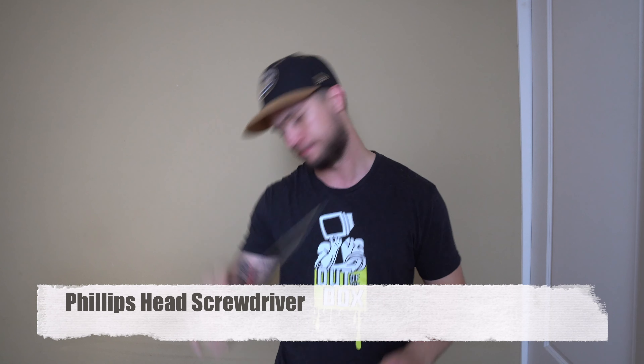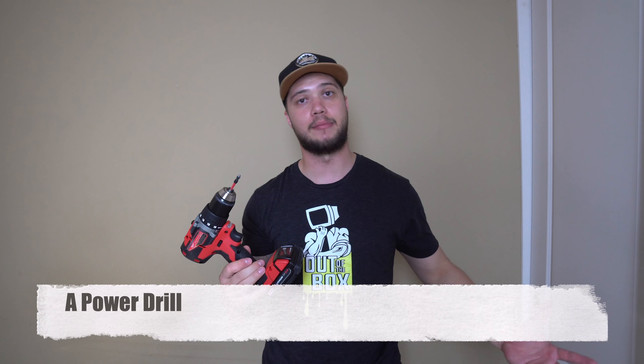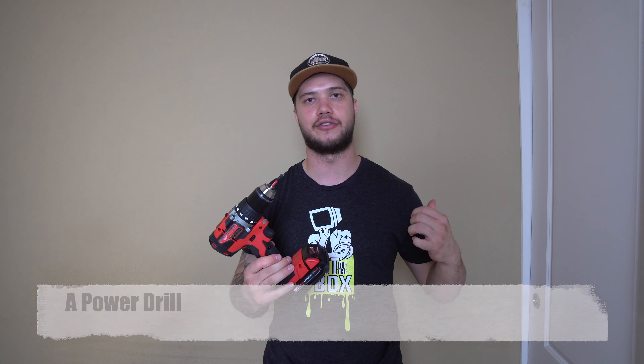So there are a few simple tools that everyone's got laying around their house that you're going to need to mount this TV onto the wall. First and foremost, you're going to want a Phillips head screwdriver. Next up, you're going to want to make sure everything is centered onto the wall, so you're going to need a measuring tape. Third, after it's centered, you're going to want to make sure your TV is not crooked — you want it to be level, so you're going to need a level. Fourth, you're going to need a drill. This is going to be an important one, so if you don't have one, just go ask your neighbor, a family member, or a friend because somebody has one of these things.